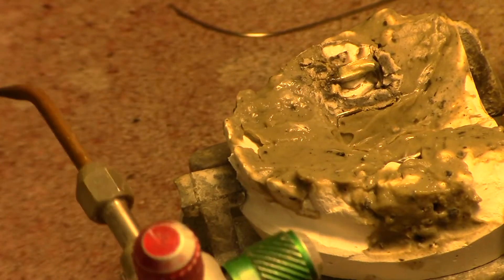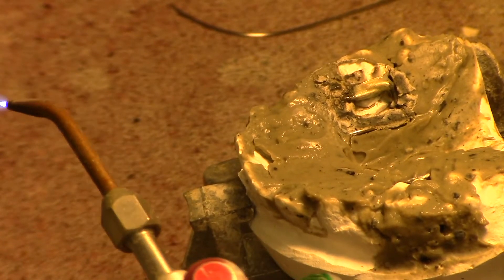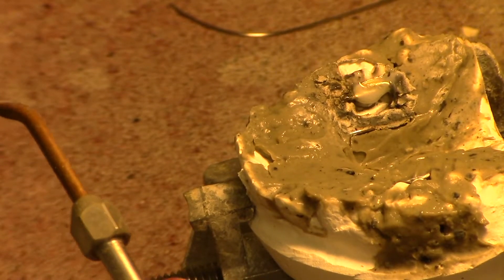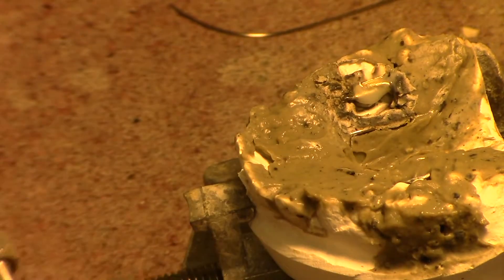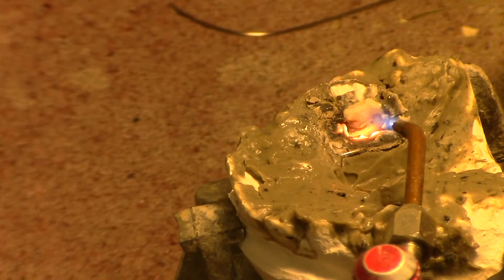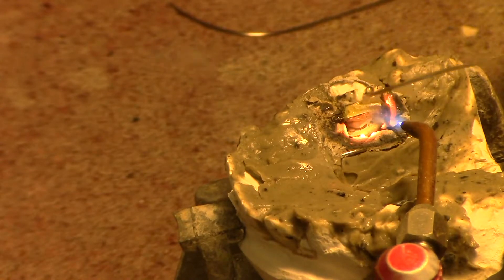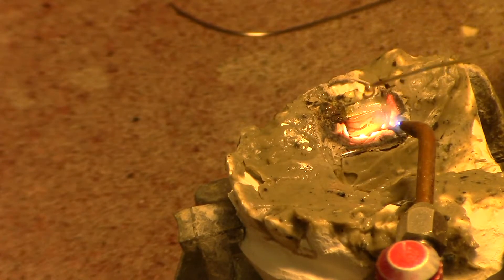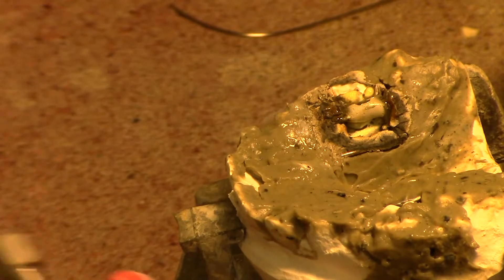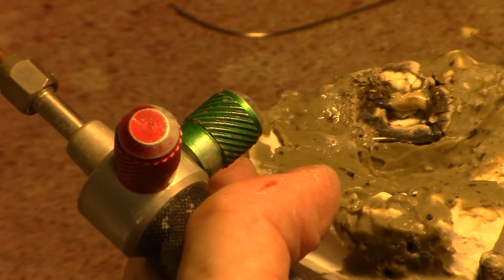Because I used that probe, I've got a really good sweating going on — that is really good. If I want, I can reflux — there's no problem doing that — it just makes sure you have a good tight barrier against oxidation. Then I'm going to build up some solder on top of that. Moving my flame in and out, back and forth, to control the heat. We've got a pretty good cover — everything is covered and the wire is tapered so it's covered on that end.